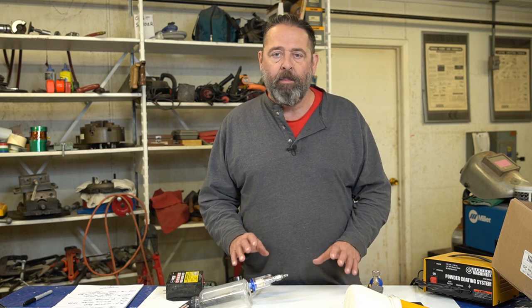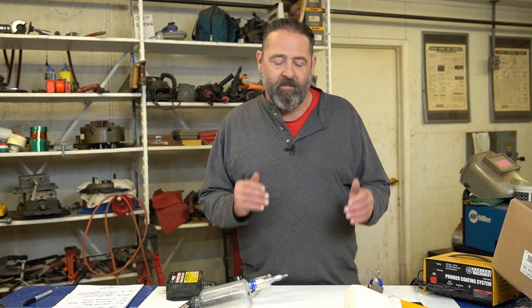The best thing about having a ground rod just for your powder coat unit is that you can put it very close to it. That's very important. Mine is about 8 feet away, so it's right there. Another thing is, wet the grounding rod down before you use it. That will help the conductivity be stronger and create a more charged negative side for the positive particles to stick to.